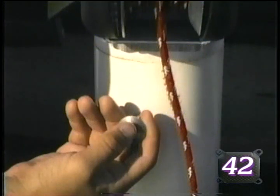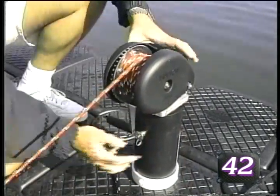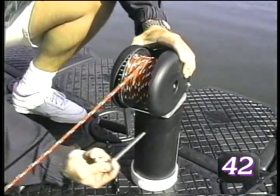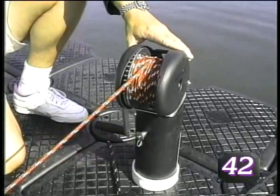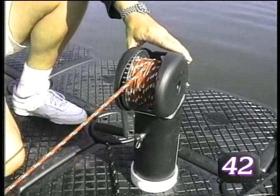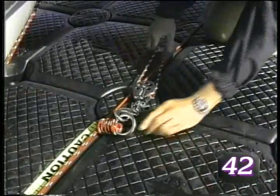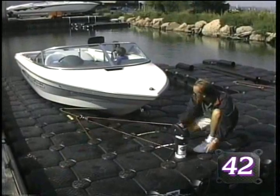The detent pin must be inserted completely through the pedestal at all times of winch operation. Remove all tension from the winch system. Remove the detent pin located on the winch pedestal and rotate the winch so that it is pointing towards the stainless steel ring located on the starboard upper surface of the dock. Extend the winch hook and connect to the stainless steel ring. Reactivate the pawl on the winch and begin to reel in the winch line.